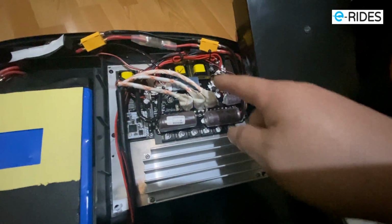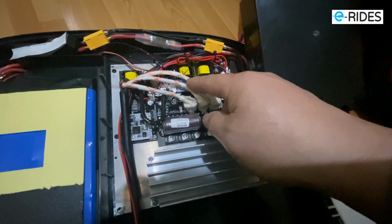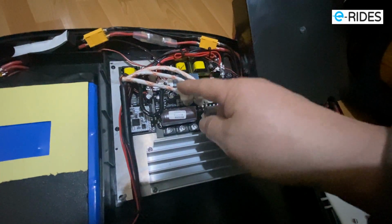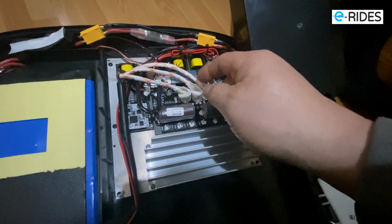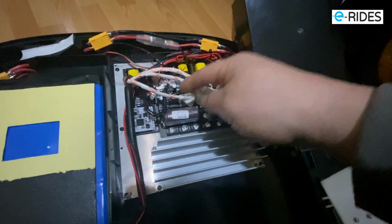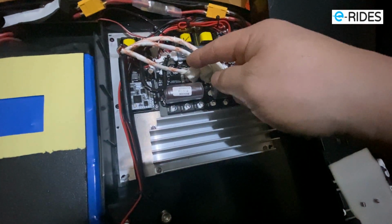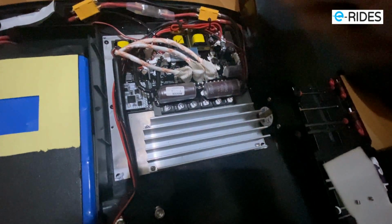And inside, you will see the motor cable going round on top of the Bluetooth receiver. So what you need to do is move this cable, these two, down to here. What I usually do is move this one down to here and move this one on the top of here, away from the Bluetooth. And that usually stops the interference that caused the Bluetooth music to cut out.